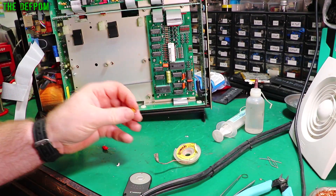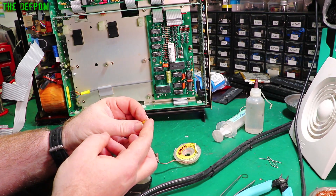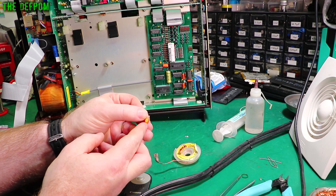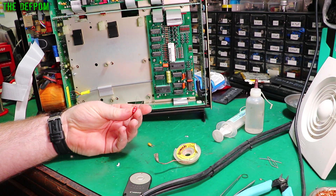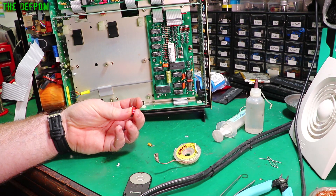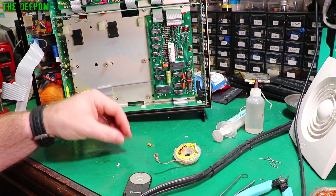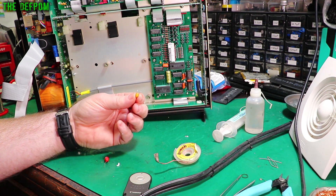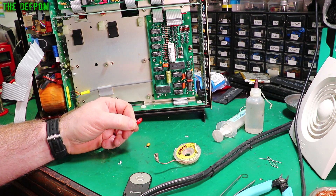So I've done the electrolytics in the power supply and now I'm doing the tantalums. The one I was worried about on the 5-volt rail is indeed a 6.3-volt tantalum, 47 microfarad. The closest I've got is a 10-volt tantalum, 100 microfarad — that'll have to do. It's a bit of an upgrade. Hopefully the big value difference isn't a problem — it might result in more noise, I'm not sure. But I definitely don't want something only one volt above the power supply rail. At least this is double the supply voltage.